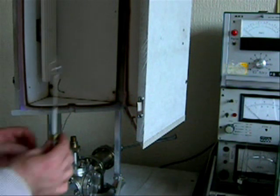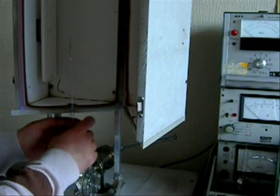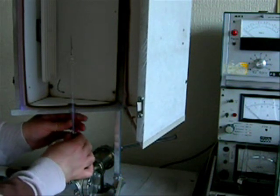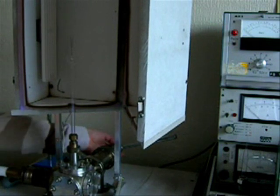The lamp is then ready to be attached to the vacuum pump. You may be wondering why the oven is on top of the vacuum rig. I designed the annealing oven in this way so that it can double as a bake-out oven for higher vacuum devices such as triodes at a later date.